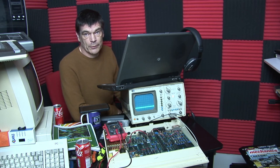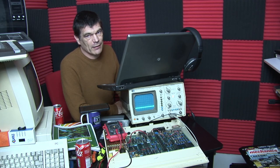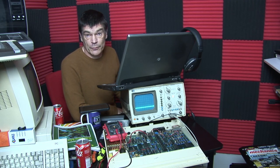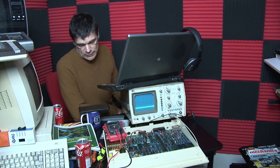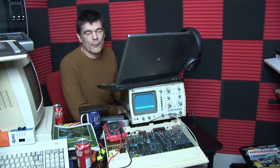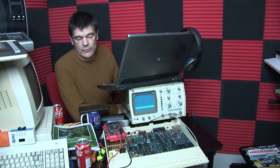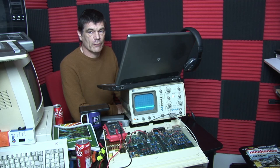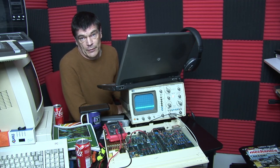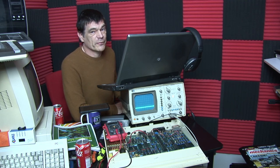I have the spares, but I'm very, very rapidly running out of spare parts for these machines, especially for the BBCs. They were very well engineered — in fact, basically a little bit over-engineered for the uses they were put to at the time. But they also have their Achilles heel, which is failing capacitors especially in power supply units, failing processors, failing ULAs, failing everything really — especially the proprietary chips and processors and ICs which you won't find anywhere else, like the Acorn branded hardware on these machines.